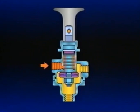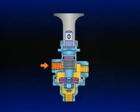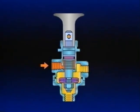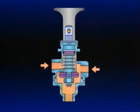The PP-1 is manually applied. If supplied pressure decreases to a specified minimum setting, usually 40 PSI, the PP-1 will automatically move to the exhaust position. The plunger pops out, releasing air through the exhaust port. Pushing the plunger back in to the applied position reactivates the control, but supply air pressure must be above 40 PSI for it to stay in.